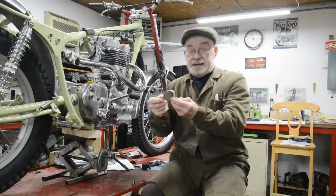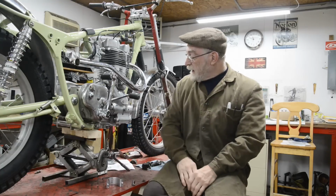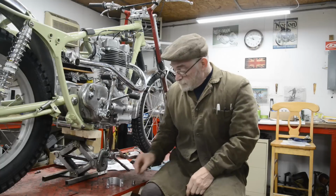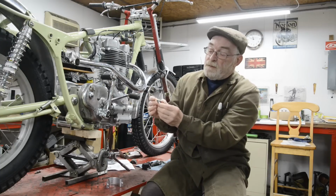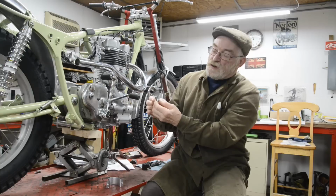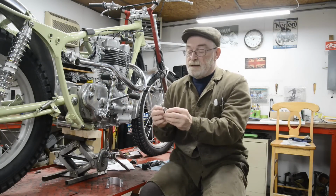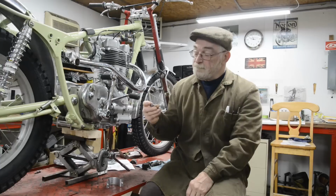See, that goes up inside the tank, bolts into the tank, and then a cross piece goes on there. So I made that. So then I thought, okay, I put the new rubber in, the big O-ring thing in the chain case, and thought, let's make sure the chain case fits and everything. And then I suddenly realised I didn't have the big collared nut that holds the chain case on. So I thought, bugger it, I'll make one. So I made one of those as well, 3/8 BSC, and that was made from a piece of round. I don't have any hex, so I just made it from a suitable sized piece of round, put it in that six-sided collet thing I have, and went round and did the sides. So that came out nicely, and to keep one of my viewers happy, Bob's your uncle, Fanny's your aunt, there it is.